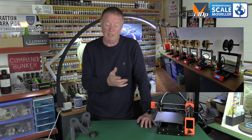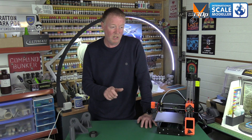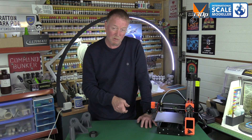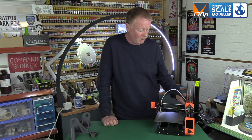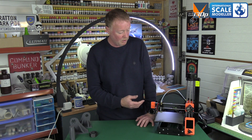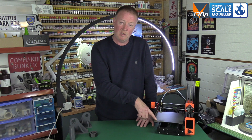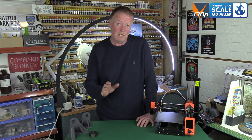After five days, it wouldn't home. Then I tried turning the controller knob and all of a sudden it just stuck — I couldn't press it, couldn't turn it, couldn't do anything. The only way I could turn it was with a pair of pliers. Then I could hear a binding sound in the Z block. So three things happened all at once. When trying to do a first-layer calibration or re-home, it would step up, do a bop-bop, and fail on the first line of the three-point calibration. I contacted Prusa, sent them videos, and they said to send it back and they'd send another one.